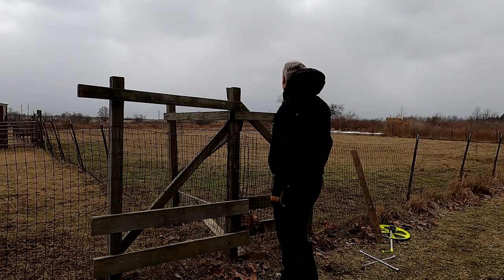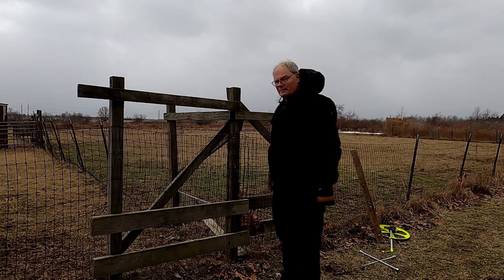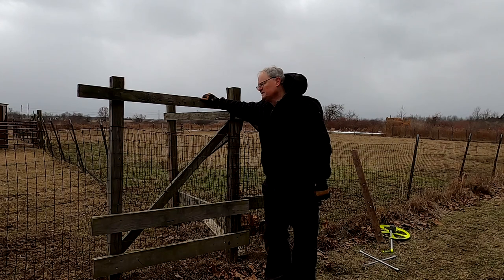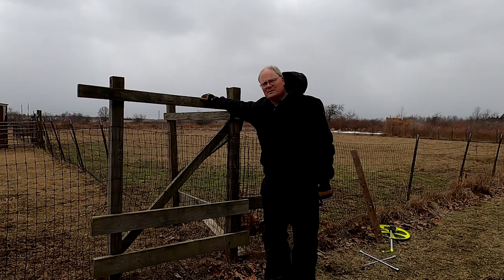And there's a lot of them. 1, 2, 3, 4, 5. So you might ask, why did you do that? Are you clinically insane? At the time, it didn't seem like such a big deal. It did seem like a big deal, actually. You're digging this post by hand. You have to go down 3 feet, at least, to get below the frost line in the winter. And I can show you that if we can scan around a little bit here in a minute.